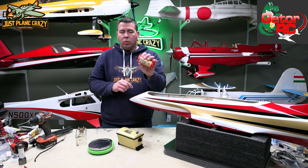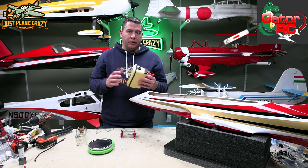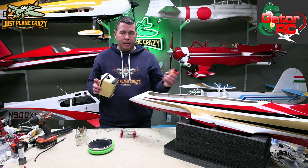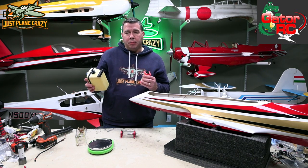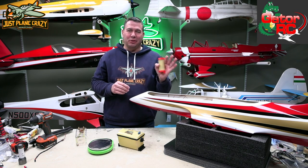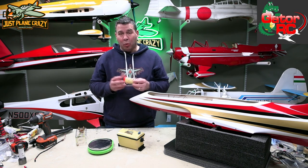Carlos can make this with whatever fittings you want — Festo fittings, barbed fittings, whatever. We're going to run 6mm on the backside everywhere, because that's the size of the nipples across the board. We'll use one reducer to get down to 4mm right before the fuel pump, and everything after that will be 4mm as well. We've reached out to a lot of different people and forums, and what I've really found is you ask a question and you get 50% this answer and 50% that. You've got to take a little from both, make your own decisions, and test what works for you.